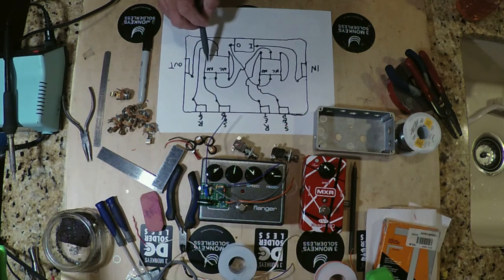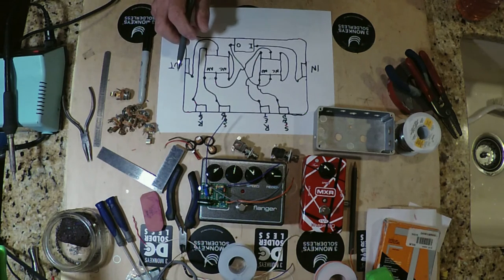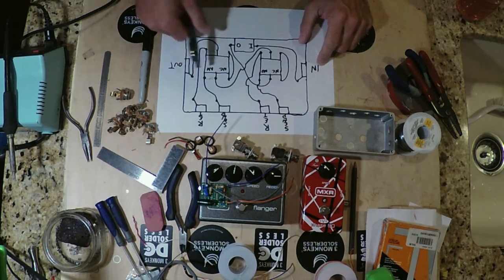Okay, so we might use a potentiometer in there to kind of dial it in by ear, because I think that's really the way it's best to do it. You could do it by math, obviously, but math has its place. But when you're talking about listening to something and, just a smidge more, a smidge less, why sit there doing calculations when you can just twist a pot, read the pot, and replace it with a resistor of the same value? So that's what we're going to do.